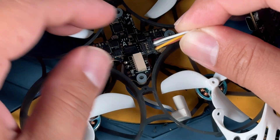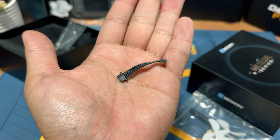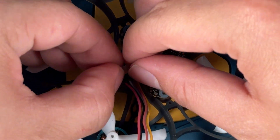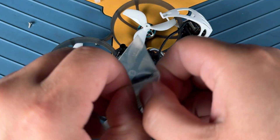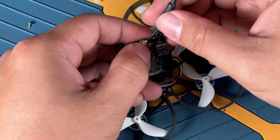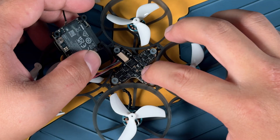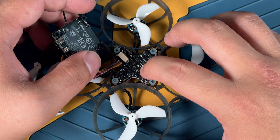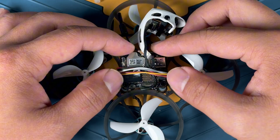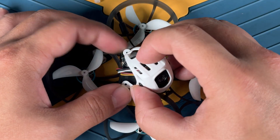You're just going to be plugging in the cable. This is the cable originally coming with the O4 — it's a little bit long, so potentially we'll make a shorter one to save on weight later. Something I later noticed is that in the package there is actually a shorter cable for the O4 unit, so if you want to use that it's possible. Next, bring out the antenna and plug it in. One thing to note is that the board actually has an arrow pointing a direction, so that will be the front. Mount the board so you can avoid the wire having contact with the flight controller to prevent additional friction.